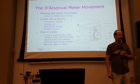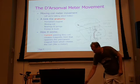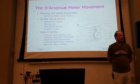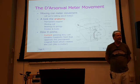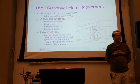I used to work in a nuclear power plant. One of the major manufacturers of transmitters was a company called Rosemount. I think they're still around. The typical loop range was 4 to 20 milliamps, 1 to 5 volts. At the beginning, when Rosemount started building a lot of transmitters and people started calibrating them, a lot of the plants started using really good Fluke meters to do the calibration. And they started to see that they weren't working right. They were off by quite a bit, because sometimes you need a lot of accuracy on those things when you're only talking about a 1 to 5 and 4 to 20 loop. Rosemount finally came back and said, you've got to use the Simpson.